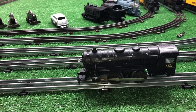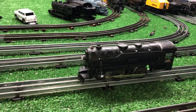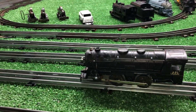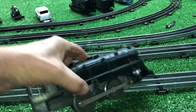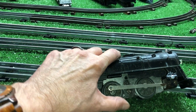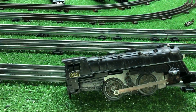I had to break this engine loose with a torch — there was no way that armature was going to turn, it was absolutely frozen on its bearing on the other side. So I just used a pinpoint flame and heated the output shaft right there, and just slowly began to turn it. After it went around once or twice, it broke free and I oiled it.